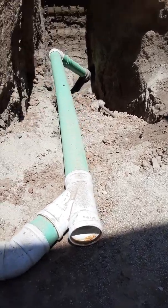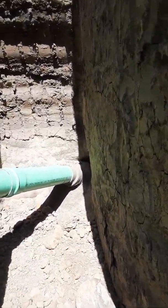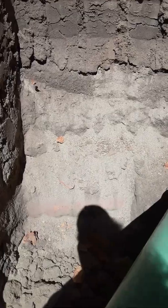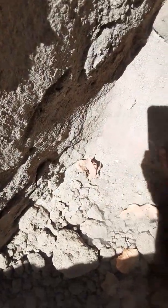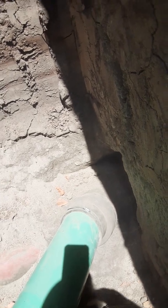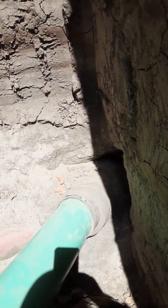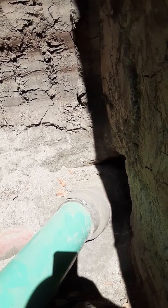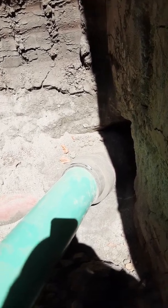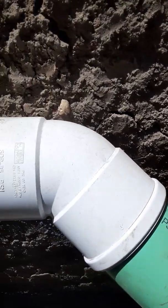The outlet comes over and ties into your sewer main. We have an eight-inch clay pipe over here. It's a bit foggy to see, but you can see the clay pipe. We had to cut in a tee — it's a saddle, we had to knock a hole in there and put a branch in. A piece of piping they call a saddle — it's like a Y saddle. We cut that in, put epoxy, and then concreted around it for that tie-in. This type of piping is called SDR 35.